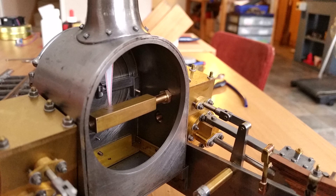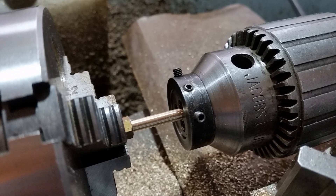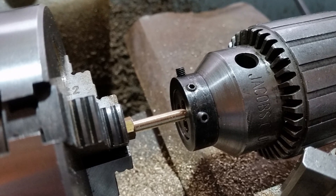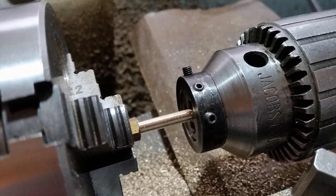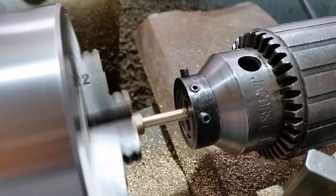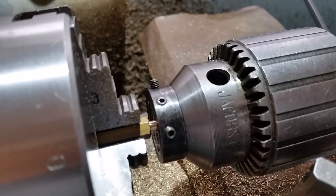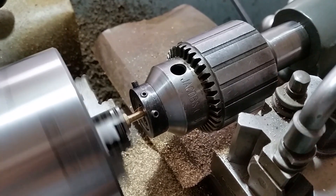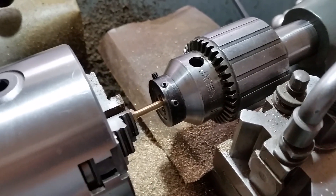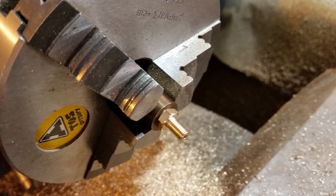Halfway into the steam inlet manifold — I needed this for the chassis air test. Starting to thread 3/16ths by 40 TPI on the left-hand end. It's 5/16ths AF brass bar turned down to 3/16ths, 4.925 inches long. Power threading at 200 RPM. Power reversing the split die off the job. The thread after power cutting. Finishing the second end in the screwed bush.